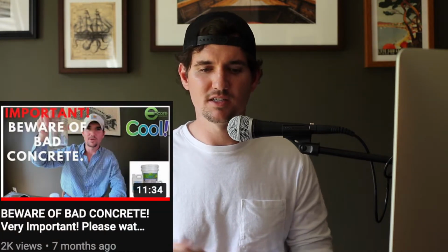So it's very important. If you see this, it's an automatic red flag, and what you need to do is use a densifier, okay? If you go watch my bad concrete video, I go into a little more detail, and I actually demonstrate how a densifier works, okay? But a densifier is a product that will penetrate deep into the slab, 3, 4, 5 inches, and grab all that bad stuff that would interfere with a coating. It will reintroduce it into the bad concrete, okay?